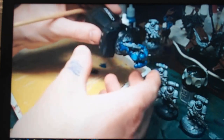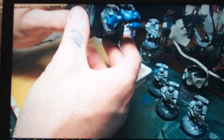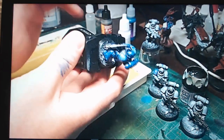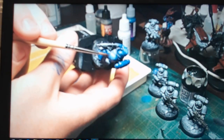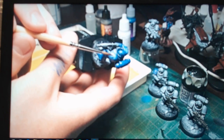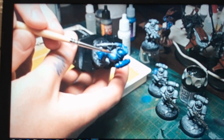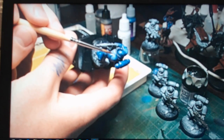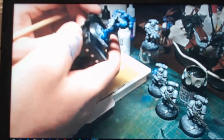One thing to mention — the paint looks a little choppy. My first instinct is to go back and get another layer of paint on there to clean it up, but I have to resist that urge at all costs. If I go back over this before it is perfectly dry, I'll actually tear that paint. The top layer might be a little dry but right underneath it's still curing, so as soon as I move that top layer it's just going to peel right off and you'll get a little crater of paint. Patience is key — wait till dry.